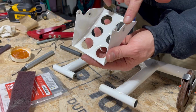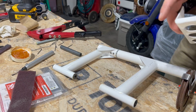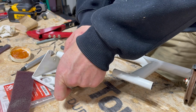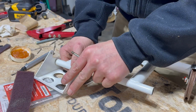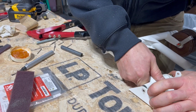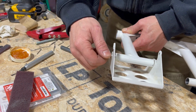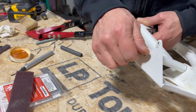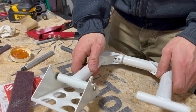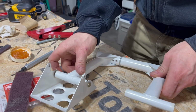Pedal goes on with the bolt goes through this hole here. The top piece, this is where your brake cylinders I think are going to hook into. And these bolts on the pilot side go from the inside towards outboard. These are a nylon nut, and even so, they do recommend torquing 20 to 26. Now I'm going to try to go for just 20, and that's because every time I tighten it up, the pedal doesn't want to move.